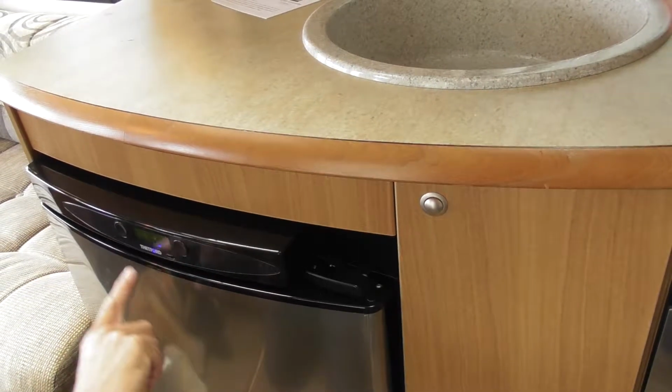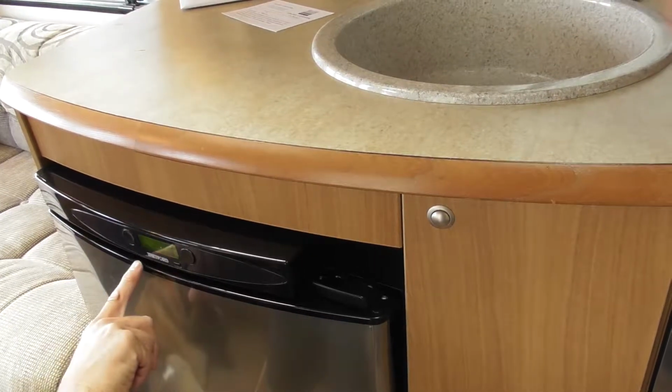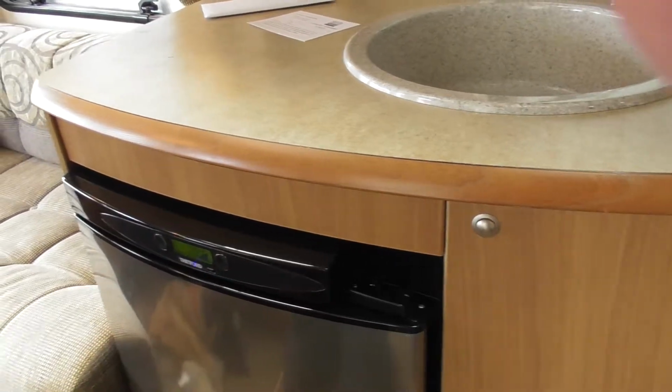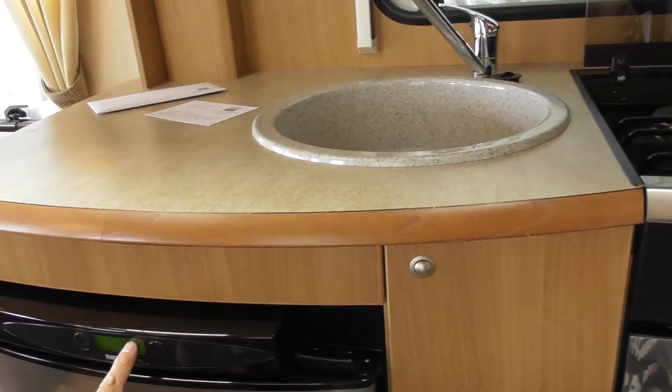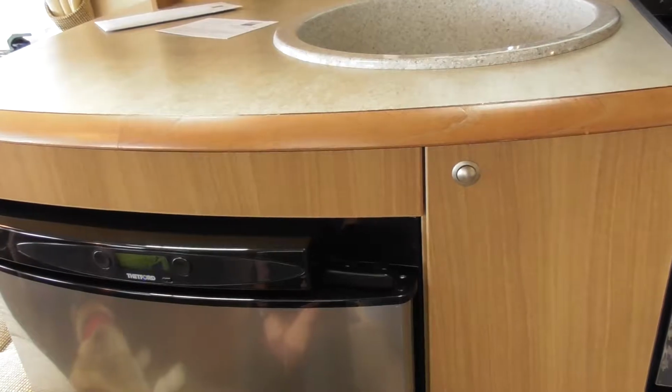That's your on-off. What I'll just show you now is if the gas fails to light. So I just put on battery icon because I can show you the failure. Because obviously it realises no car there, nothing connected. So a blue light starts flashing, and you've got a spanner there. If you're operating on gas and it's doing that, it's failed to light.